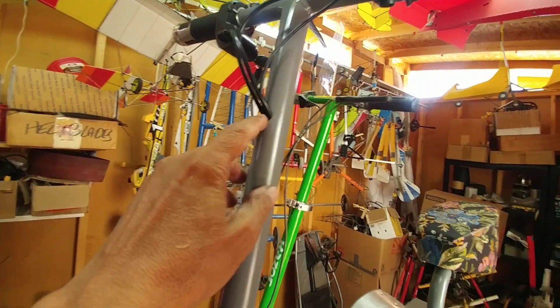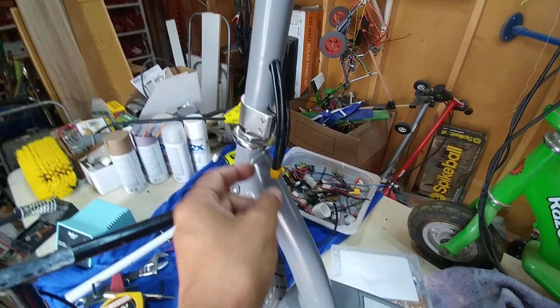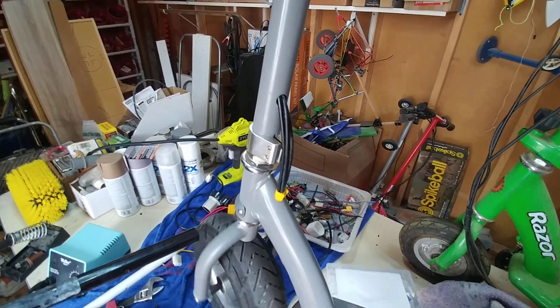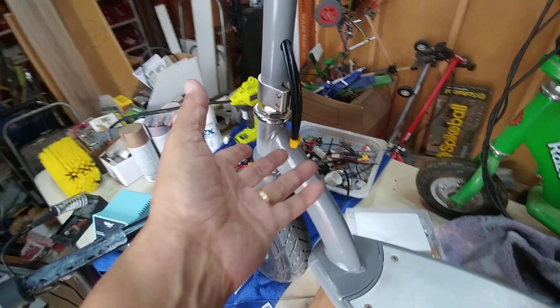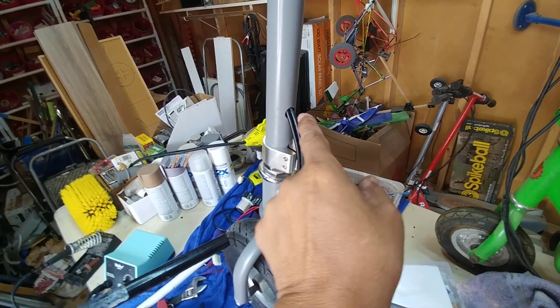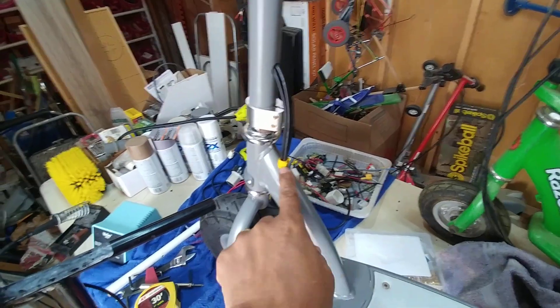In the first part I talked about how I made these holes to allow the cables to go through, giving a much cleaner setup instead of having cables clamped on the outside with tie wraps. I decided to route the cables through so when the wheel pivots the cables pivot along with it. This polyethylene sleeve goes all the way down and stops at the bottom inside the tube, providing better protection so the cable sheathing doesn't fray inside the raw hole.